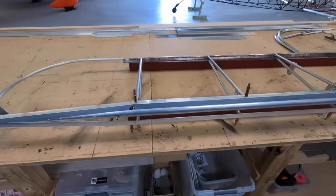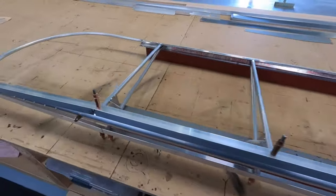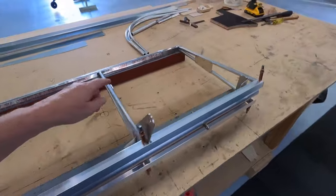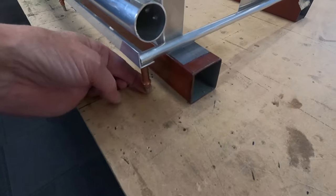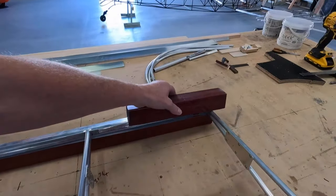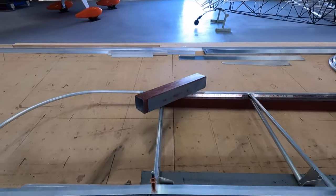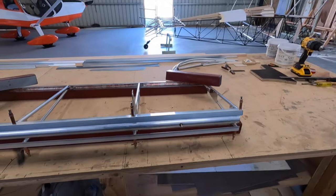All right, first aileron. Got the front boxed in. Now I'm gonna sheet the front. Important thing for me is I just gotta keep it flat. So get back to the railway sleepers or these square tubes I've got, which are good because they're slightly higher than a Cleco. So I can keep the job flat. I think I'll put some weight on the trailing edge corners. Like that. Now we're flat. And we'll sheet the front of this one in.